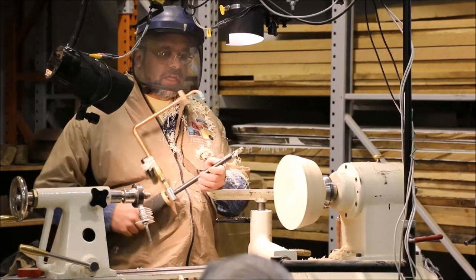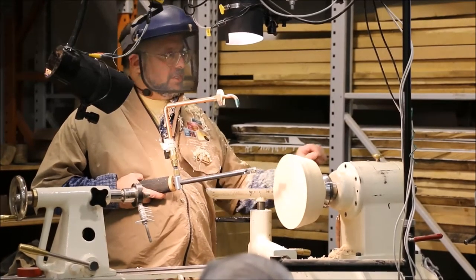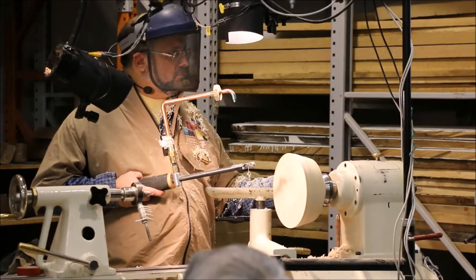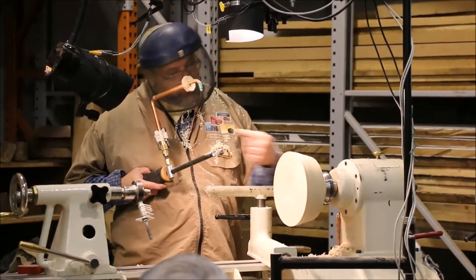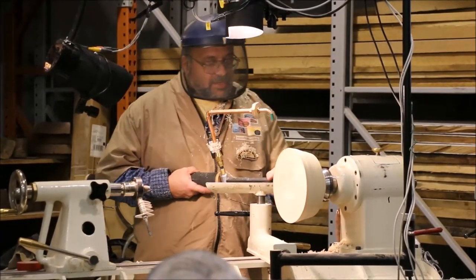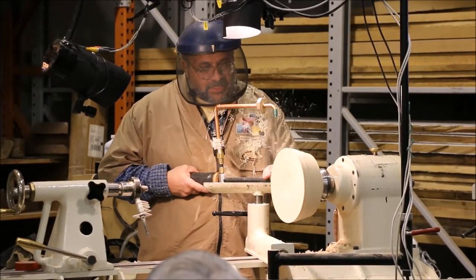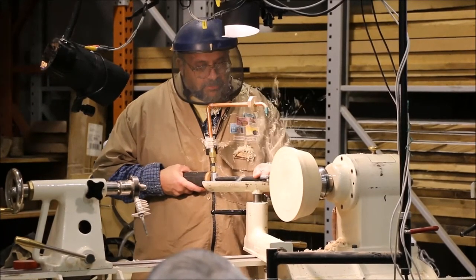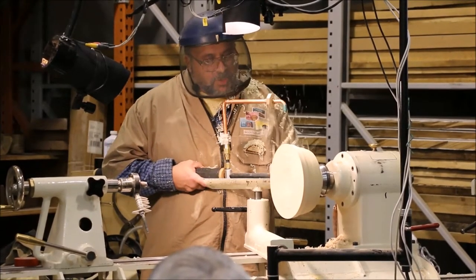When I go inside a piece, I'll always have the lathe in reverse. So I always use the right-to-left motion as my roughing motion, and left-to-right is the finish cut. I'll start low and come in and go across — you can see it's cutting quite nicely. I can go either way. When I go back the other way it's cutting rougher, because more of the cutter is exposed.